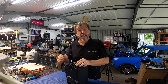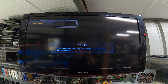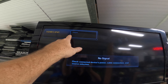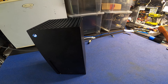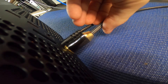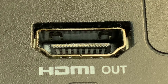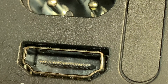Let's start off on the television and have a quick look. We'll turn it on. What this one's doing is basically not displaying. With this particular model of TV, when I have got an HDMI signal, it means the television can see something coming from the HDMI port, but I don't have a screen resolution — so it's not actually sending a signal from the console itself. Let's pull it apart. We'll turn that off, unplug the HDMI, and get a nice close-up look of the HDMI port from the outside.